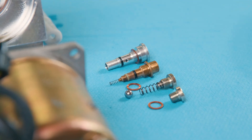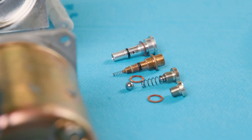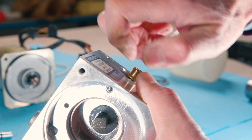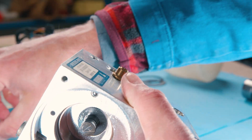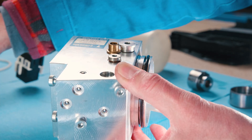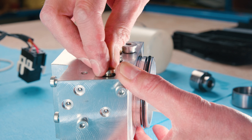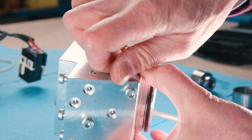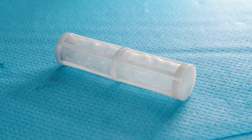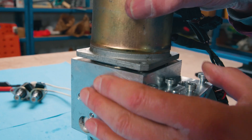Here's the left side block assembly. The brass-colored relief valve has a critical maximum torque of only 3 Newton metres and should never be used under hydraulic load. To prevent it from being unscrewed too far, there's a neighbouring screw with a wide cap. Below it is one of the spring-loaded ball valves. On the right side it looks similar, and on the reservoir side the sieve filter can still be removed and inspected. Going deeper into the motor or valve block requires the expertise of a specialized workshop.